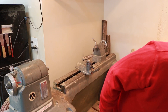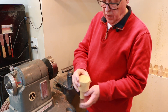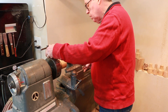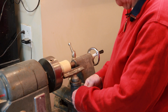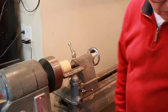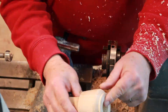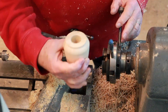So let's go to the lathe now. We're going to start with this machinist chuck here. I'll thread it on. I do have a center mark here from when I prepared this block, so I'm going to put this in here — not all the way to the bottom, just part way, and hold it loose. I make sure I've got it on center with the tail stock in there. It's very critical that you spin it around to make sure you're clearing the jaws. Now I'm turning the bottom and creating a foot so that I can use the other chuck. Now I'm counter-boring here to check it and make sure it fits the PVC. This other chuck needs to have that area to grip on, and I'm counter-boring it to complete the hole. I check my progress with the PVC.